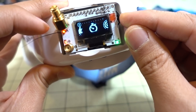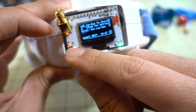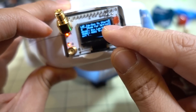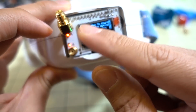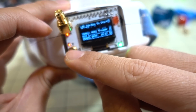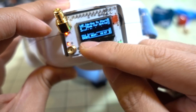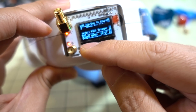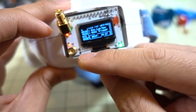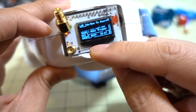There's a mode called Lap Timer. You put a patch antenna on antenna B, and it uses the RSSI on antenna B to measure your laps based on how far away and close you are to your location. When you pass nearest to your position the RSSI peaks, counting as a lap, and as you go further away the RSSI drops. When you come back and the RSSI increases to maximum, it counts that as another lap.